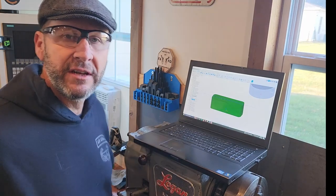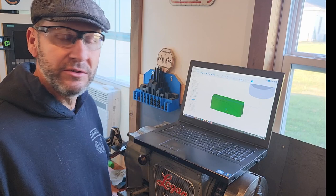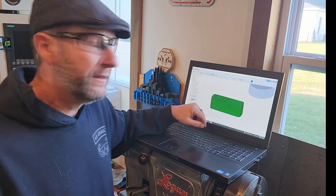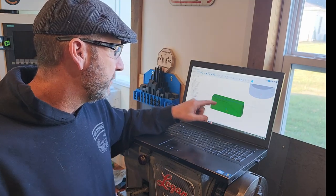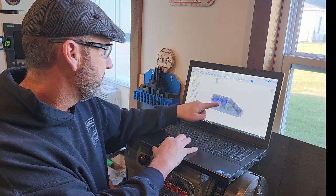And then I'll have a nice clean surface to get a new Z height, a new G54 in the Z on top. Actually, and X and Y. So I'll get a nice accurate G54 on a fully machined surface to then go on to do the bores.